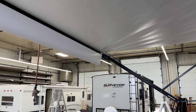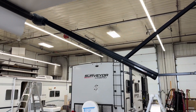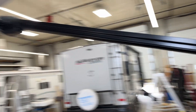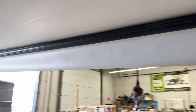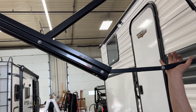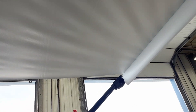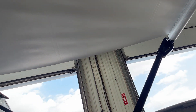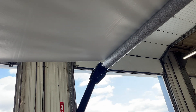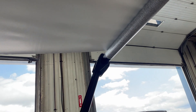Once you see the flap and tube, stop right there. If it starts raining, the awning will hold some water anyway — grab either arm, front or rear, and pull straight down to change the pitch of the awning and allow water to run off. You can do the same with the front arm if you prefer that angle for more shade. Before bringing them back in, make sure the arms are back out straight so you're not bending them. Then press and hold 'in' — the awning will retract. Watch to make sure the fabric stays over top of the tube. Keep in mind the awning catches a lot of wind, so at around 15–20 km/h you'll want to bring it back in to avoid bending the arms.